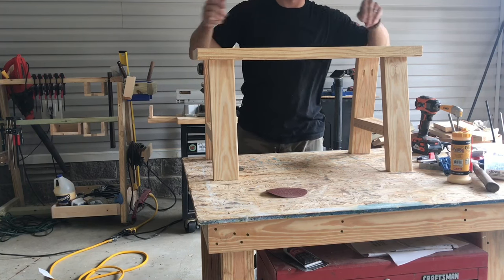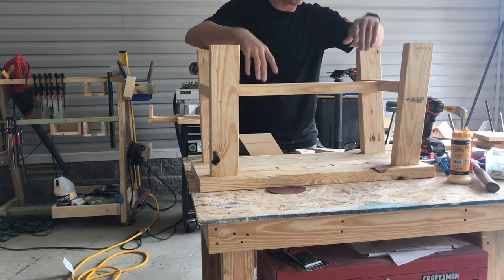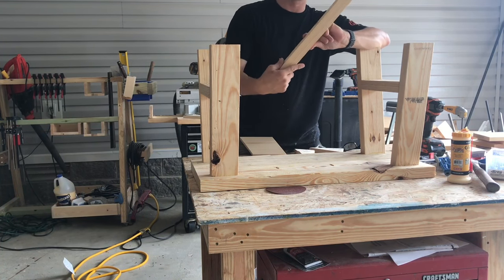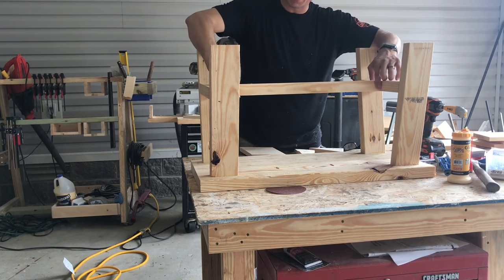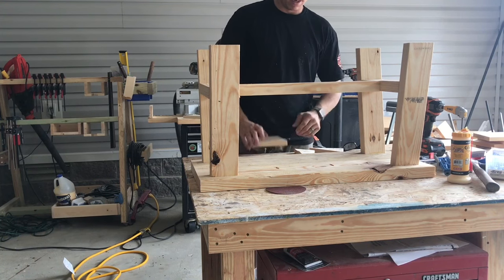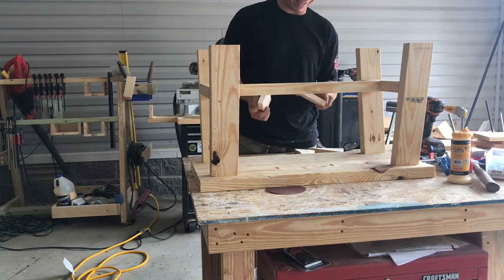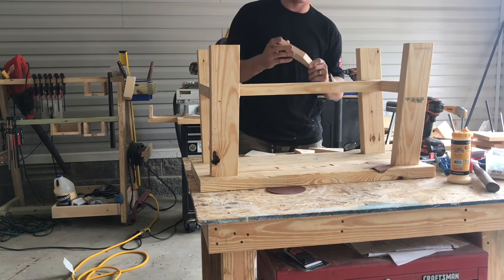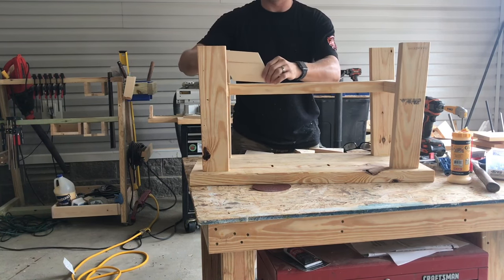What I like to do is give it a little something extra — kind of my signature thing around here. Another thing you can do just to spruce this up a little — no pun intended — is this: a two-by-four ripped in half, so it's an inch and a half by an inch and a half, with pocket holes on the bottom. I find the center, which is six inches because these legs are 12 inches long to long, and screw that in as a cross brace. What I like to do and what I call my signature bench is the arrow bench. I have one-by-six material cut at a 33.6-degree angle off a square, with pocket holes drilled for three-quarter-inch material.